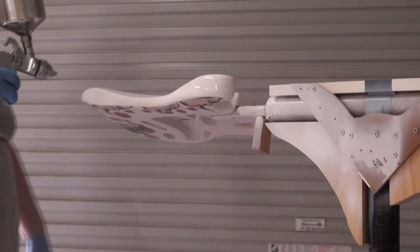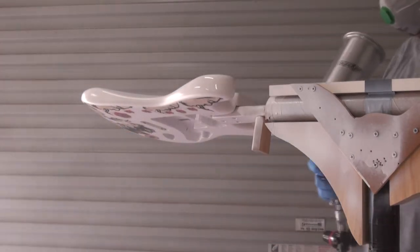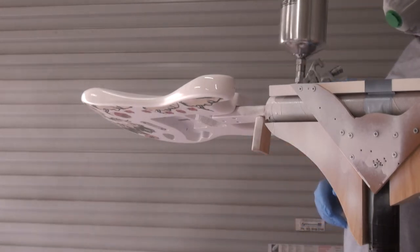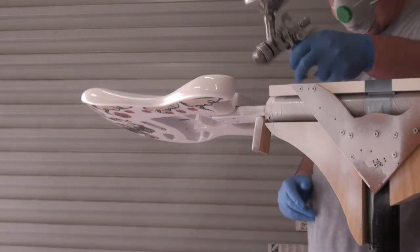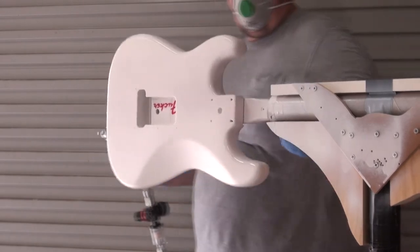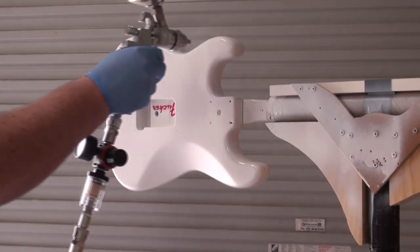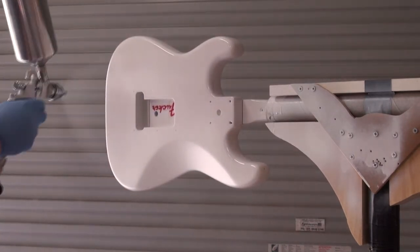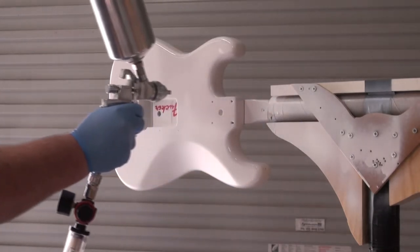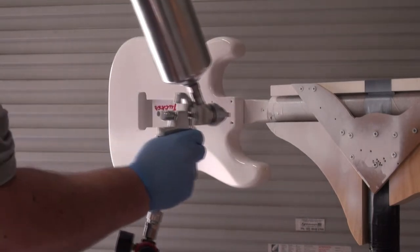The issue with such a long chain of attachments is firstly, the many connections introduce opportunities for air leaks. The next problem is the weight and stiffness. The weight of the hose combined with the straightness of all those attachments limited maneuverability, and I was constantly fighting to turn the paint gun on any kind of angle. I have since put another style of filter at the compressor end of the hose. I'm probably going to leave the pressure gauge on the end, but I will also move the oil trap down to the compressor end of the hose to rectify these issues.